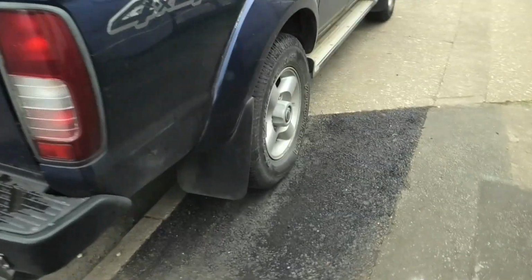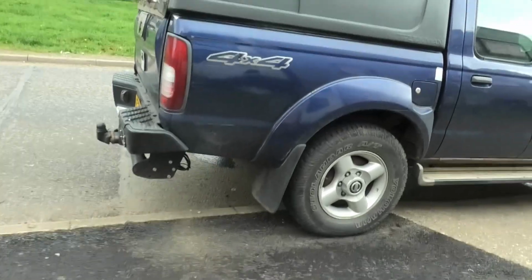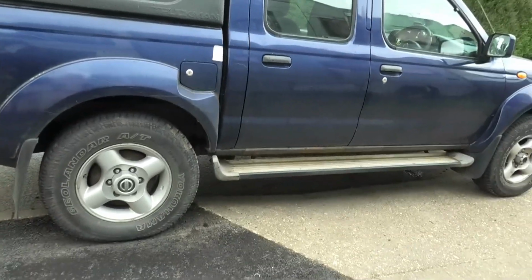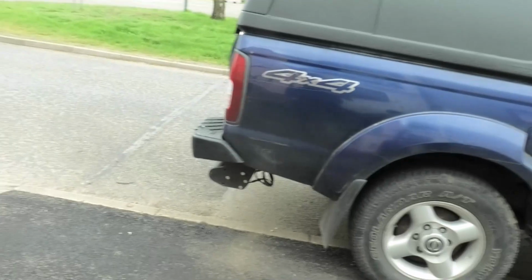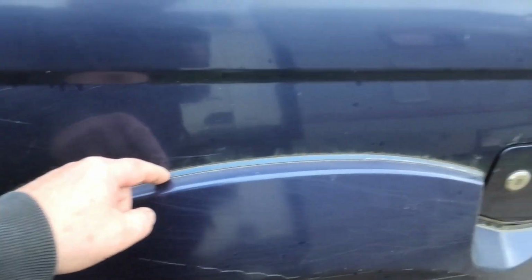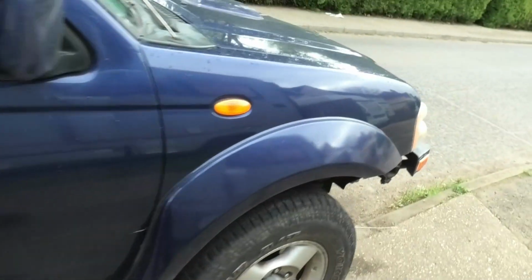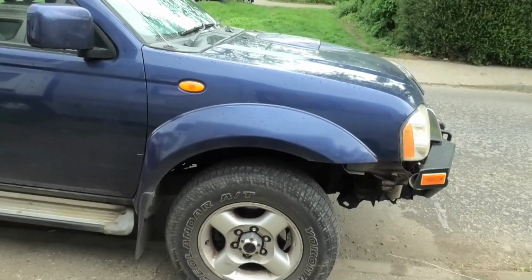So the other side is even worse. I can tell you now, as soon as I remove that rust, I will have holes, guarantee it. These things are renowned for rotting on the old vehicles, so yeah, a little bit of checker there. I did debate whether to put some on the bottom of the doors as well, but the doors are not rusty, so there's just no point to it. I don't gain anything apart from more weight, but there I actually gain a bit of protection. And I also need to order some new rubber, because this rubber's gone rock hard, and I might take the wings off later on the front and respray them in blue, because that rubber has desecrated the panel. So that's my plan.